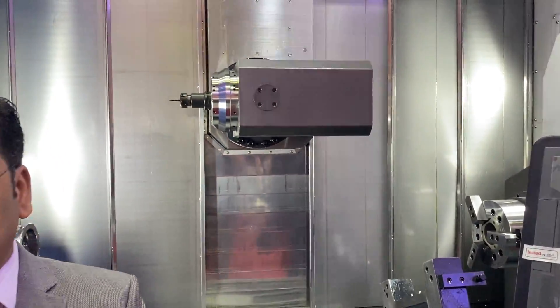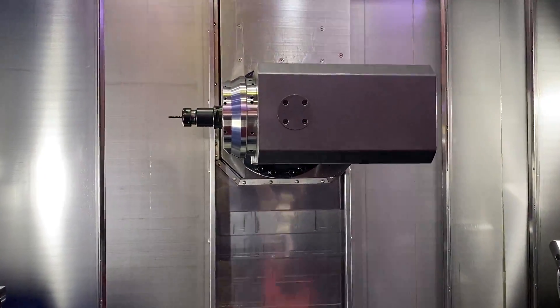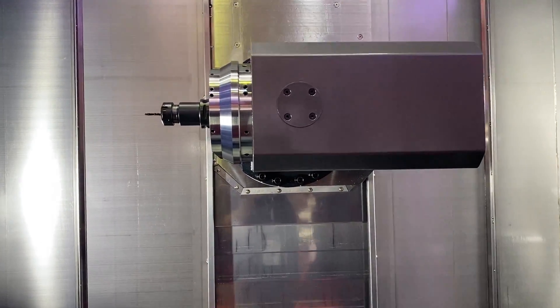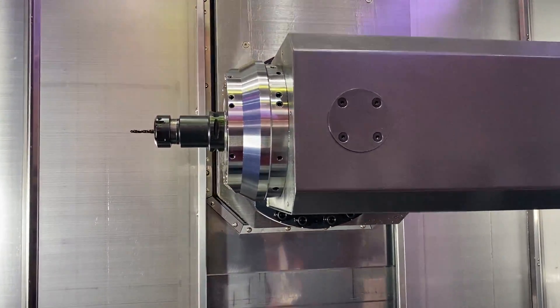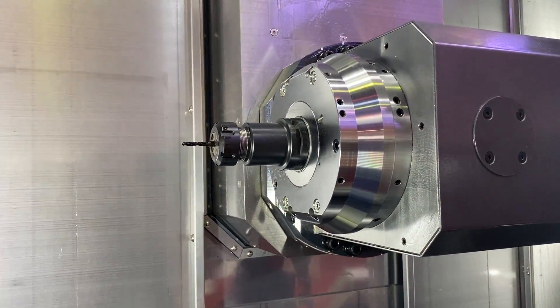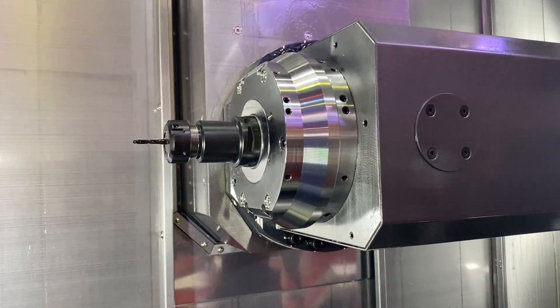What are the capabilities of that head? I can sense that we've got a lot of power in both spindles here, but what about the milling side? This machine runs at 12,000 RPM, and we have a C6 head - it's a Capto 6 head. You've also got an HSK spindle on this machine, and it's a very high torque spindle.